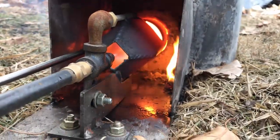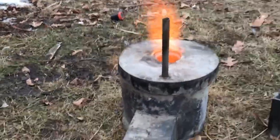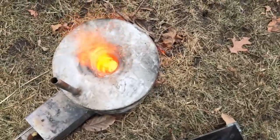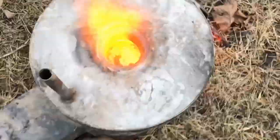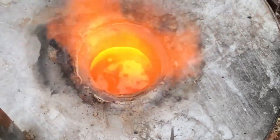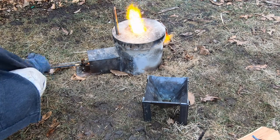Round two. I'm almost positive that green stuff is nickel oxide, because like an idiot I threw some sodium nitrate into the flux. That's probably a bad idea in this particular situation when you have nickel present, because nickel oxide is not easy to melt at all. In the second run, we don't have to run it as long because everything's preheated. So here we go.